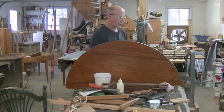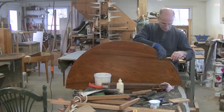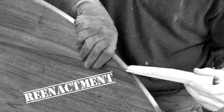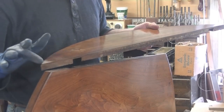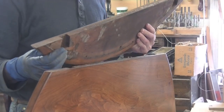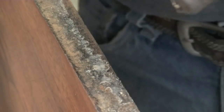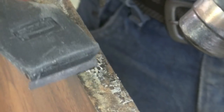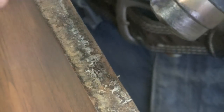I'm going to put a wedge under this end as a way of applying some pressure. There it goes. Most importantly, I was heating up the top — I didn't want to get any splinters when it came apart, and it came apart very clean. Now this joint has a lot of glue on it. Before I try washing it off, I'm going to use a heat gun to see if that loosens it up. Scrape as much as I can before I scrub it. You can see the glue is softening up and scraping off a lot easier. Because once again, I don't want to damage the wood — I just want to take glue off, no wood.